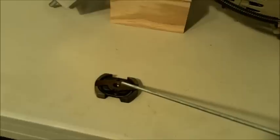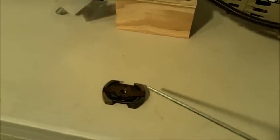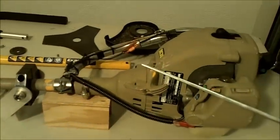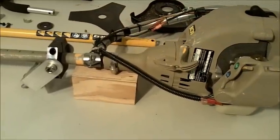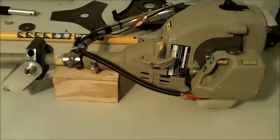I found that the drag on the clutch was just too much for it to fully engage, so what I did was take some steps that other builders have used. They've actually removed the clutch and had a clutch lockout plate made, or made it themselves. It tends to be a round aluminum disc that screws on in place of the clutch, and has ears on it that engage the modified clutch drum and turn it into a direct drive.